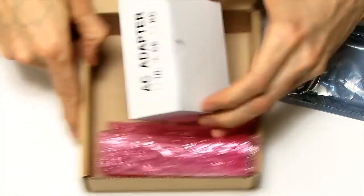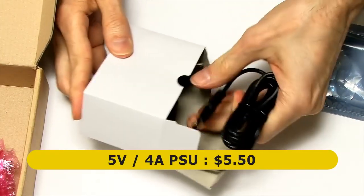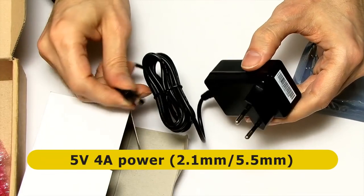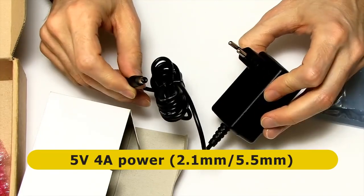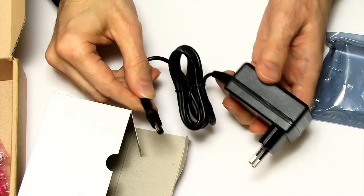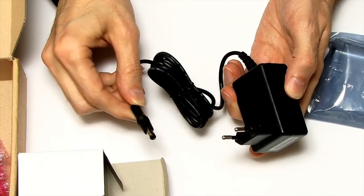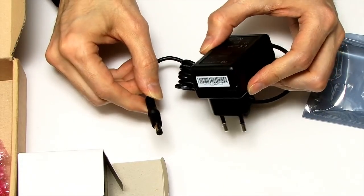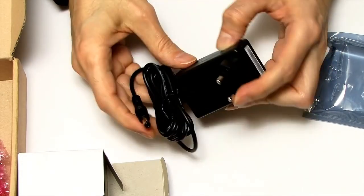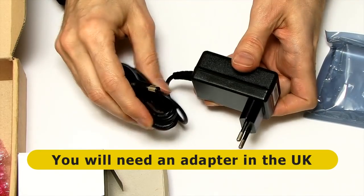Here is the power supply, which is about $5.50. You'll need a power supply with the appropriate connector — remember that 2.1mm inner, 5.5mm outer jack. I particularly want you to have the right power supply because the Odroid can draw up to 4 amps. It probably won't draw anywhere near 4 amps just running without peripherals, but if you're running something power-hungry like a drive you might need all that power. This is clearly a European adapter; there's also a US adapter available.